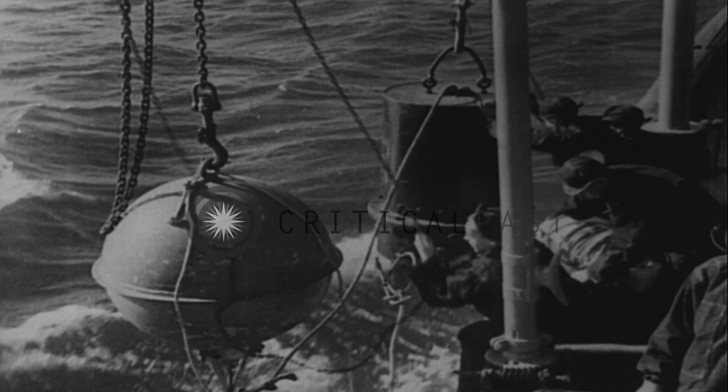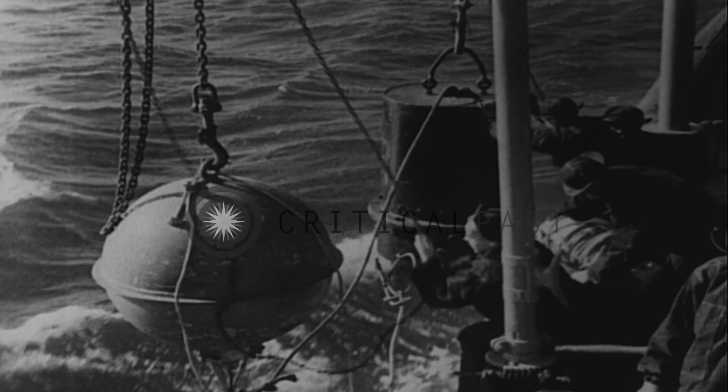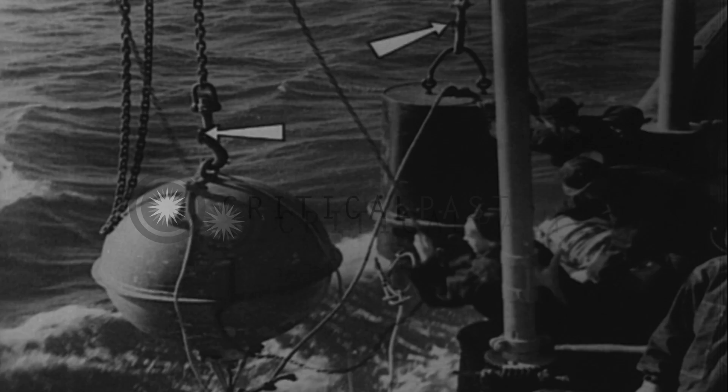This is the mooring rope which fastens the mine to the anchor. The mine and anchor are each supported by trip hooks which are made so that the end of the hook drops down when a lanyard is pulled, thereby permitting the mine and anchor to fall off. Locking pins, which are removed just before the mines are tripped, are provided to prevent accidental release.